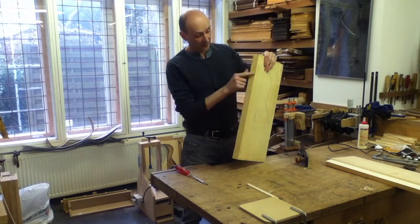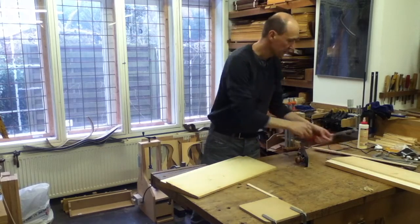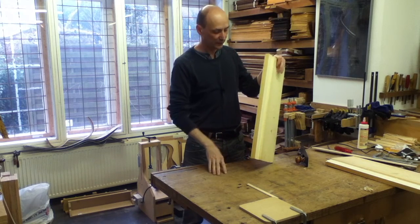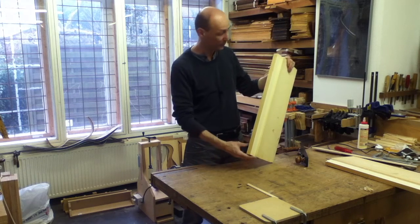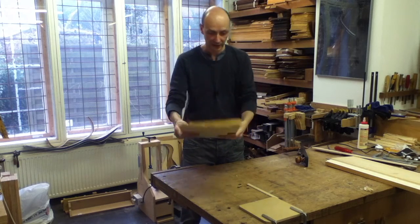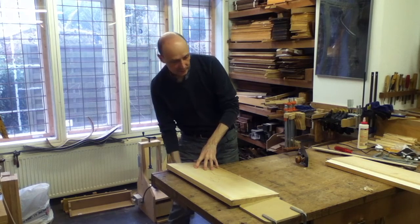I made a cut at 25 millimeters, or an inch, a bit over, and now I'm gonna take that off. Don't need that. So I now only have to true 25 millimeters width of top material, so that makes it a lot easier than having to do 50 or 40. But first I'm gonna true this plane, and then I'm gonna true this plane perpendicular to this one. So I'm gonna put this in my vise, like so, and now